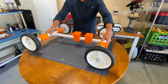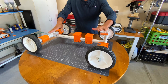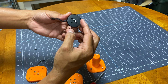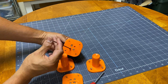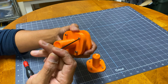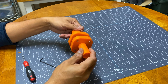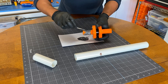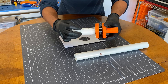I also noticed the frame is too rigid and decided to make it twist to conform to any uneven terrain, so I decided to cut the main tube. I don't have a bearing, but substituted a broken gimbal motor instead. I then glued the assembly and let it dry.